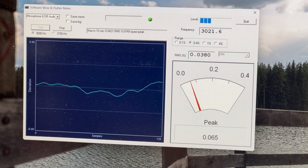I need to finish up the last few remaining parts now, and then also get at these button switches to clean them, and both of those require the whole front of this thing to come off, because I'll show you in here, there's this giant metal brace here. There are a bunch of those capacitors under there that you can't access unless this audio board comes out. And thankfully, the service manual tells you how to do that. You have to get underneath and just sort of work it backwards that way, and then it comes out. But you have to unbolt these switches here first. So let's go ahead and do that.